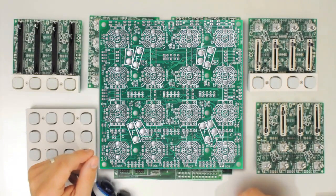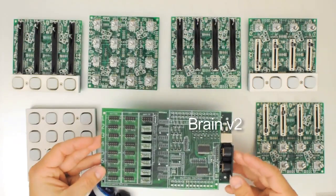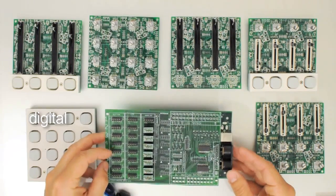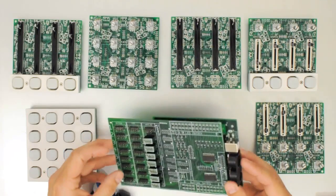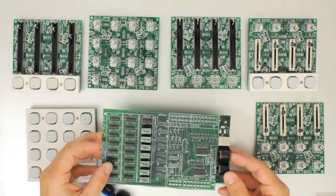The main component in Builder Version 2 is our Builder Version 2 Brain. The Brain is a class-compliant MIDI device that allows you to connect analog and digital connections to it that create a MIDI message that sends over USB. Brain Version 2 also supports standalone MIDI, so you don't need to use a computer.